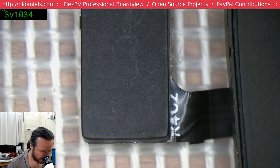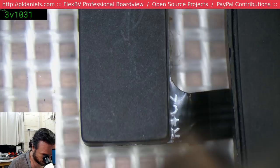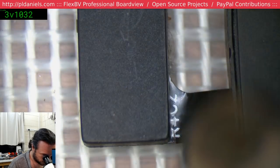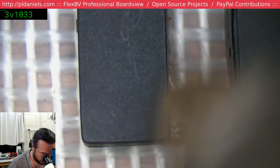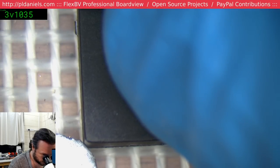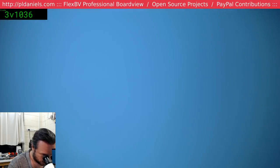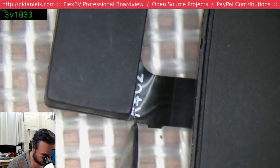Great, thanks. Alright, so as per the title of this stream, I had a machine in that I think I had on a stream a couple of days ago, and we thought maybe the battery was playing up because it would go slow. But anyway, I booted up my portable macOS system and just ran my valley test, and no matter how much I pounded that valley test and how much the CPU came up, the fan would not come up. And so I took a closer look at this flex, and as you can see, there's a whopping great big crack in it.